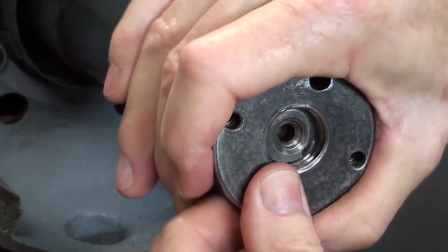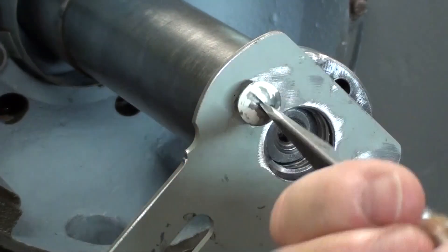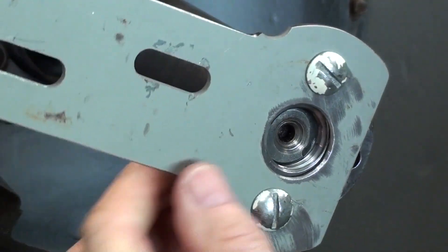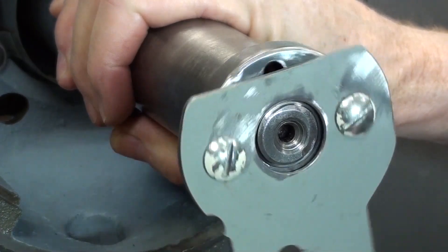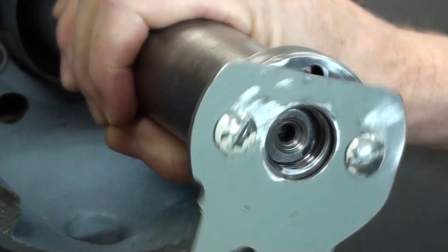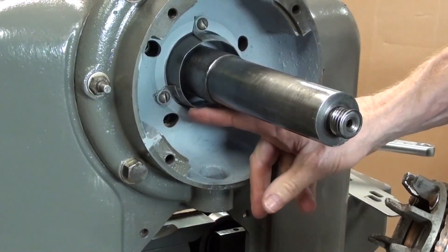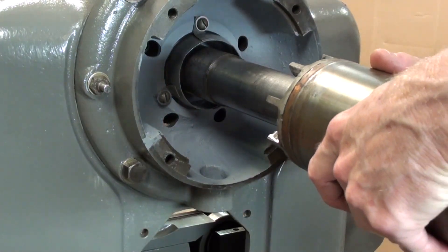It's going on a little further by hand now. I'll go ahead and put on the spanner wrench. It's pretty tight but it is going on much better than it was before. Now we're in position to put the rotor on. I want to make sure the inside of the rotor is really clean. I've got the inner fan duct on, the inner fan on, and these bolts are all torqued up. Once this goes on I do not want to take it off again.